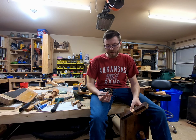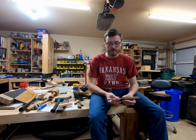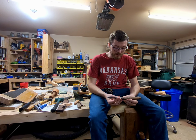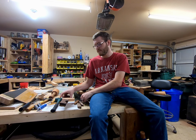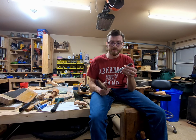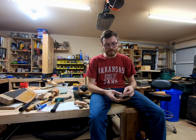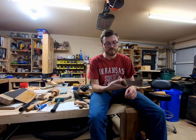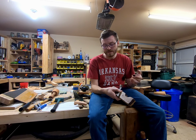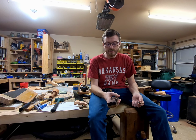No improvements. And the last time, whenever I was stress testing, I managed to break the handle that I had made for this chisel. So I'm gonna call that one kind of done. My best guess at this point is that this chisel itself, the actual blade of it, is so short that the static friction created with the wedge in this form factor is just not enough to maintain the strength needed to keep the tool together.